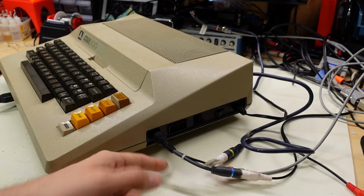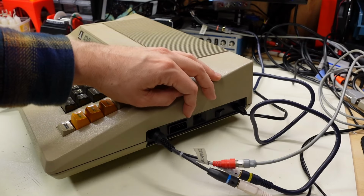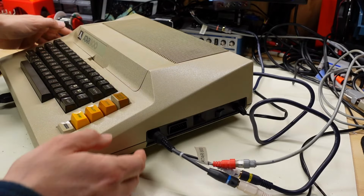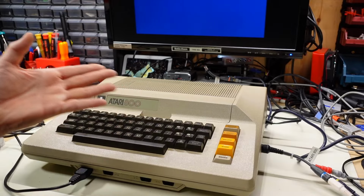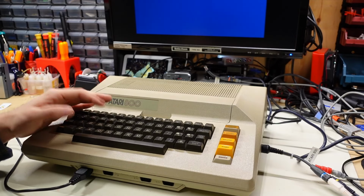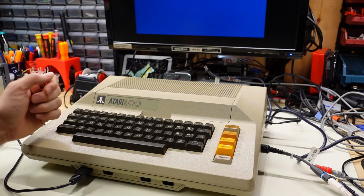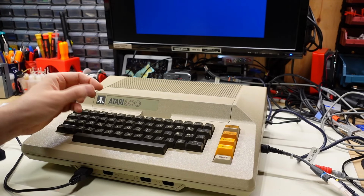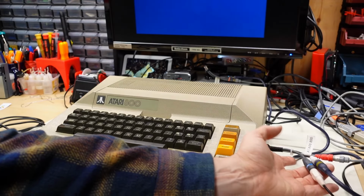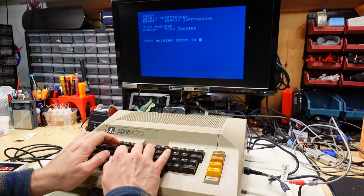And let's not forget the video output on this machine, which of course is S-Video compatible with Chroma and Luma, which is very forward thinking for 1979, along with this serial I/O connector here, which allows you to connect a whole bunch of peripherals, and they actually run at a pretty decent speed. And remember I had mentioned originally that there was a speaker inside here and I didn't remember it doing anything. Well, that's because of course the keyboard wasn't working and it seemed to be used for an audible keyboard click, which probably would have been very helpful on the Atari 400 with that flat microwave oven style keyboard, but really not necessary for a good feeling keyboard like this. Luckily, it's probably as easy as just unplugging that if you don't want to hear that beeping, at least on the 800. While on later Ataris, I'm pretty sure that that actually came out of the audio output from the video jack. And indeed, after reassembly, this machine seems to be working properly.